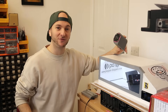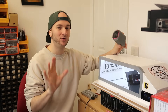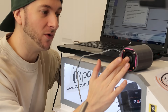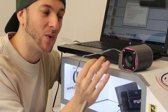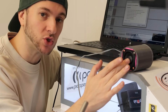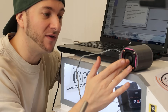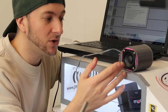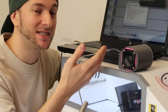What we didn't do is shove the RTA in front of it and see what the waveform looks like on REW, and we didn't see what the RTA graphs look like. It should be absolutely beautifully clean — it's a sealed box. Now, this goes for any enclosure type, but particularly prominently with sealed: it's super critical that you get a dead tight air seal with absolutely no leaks, because the tiniest air leak will actually seriously impact the low frequency response. So if you're ever doing a sealed box, you want to make sure that when you push in on the driver, you don't hear any hissing or air leaks, and you want the driver to feel much stiffer than it would be free air. If you push it in and hold it there, there will be some air escapage through the materials, but the more sealed the box, the harder it will be to push in, and when you let go, it will come back out very slowly.